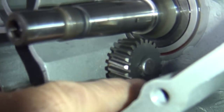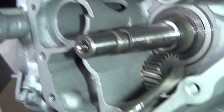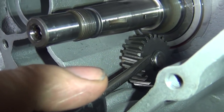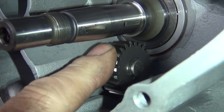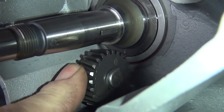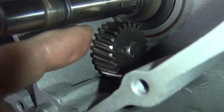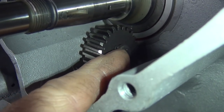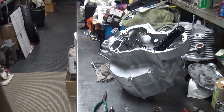Okay, clip went on. After I get the clip on there, where I think it's popped in all the way, I slide it by pushing on the outer ear and push it around to get it in the groove on the shaft — make sure it's in the groove. You can see the keyway over here. So that one's in there all the way and it's tight. If the snap ring is loose, you've got to take it back off, put another one on, or re-bend it. It has to be tight — if it's free to spin on that shaft, it'll come off. Got to make sure you do it correctly. Very important.